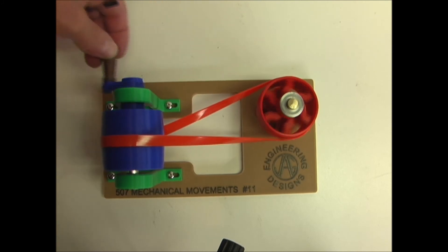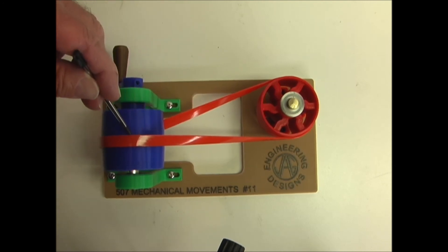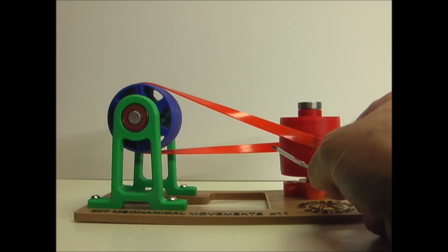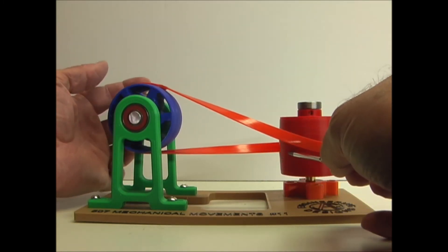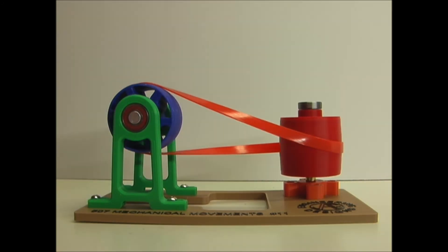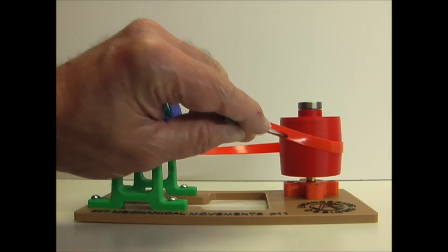So if this is going in this direction and the belt is leaving here, it has to arrive here on this pulley in the center of the pulley. You can see, viewed in this direction, where the belt leaves the pulley here and arrives at this pulley — it's perpendicular to the center of the pulley. If that condition isn't met, it will work itself off of the pulley.